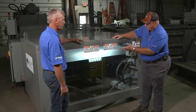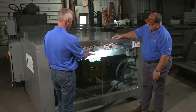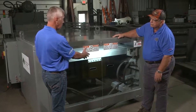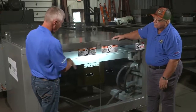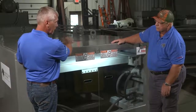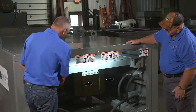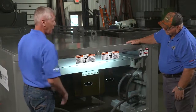The grease station and the placement of the hydraulics — our intention was to bring the majority of what we need to pay attention to and keep an eye on to the back of the baler, so it's visible through our panels. The grease station hits all the points that need grease: the pins and the shoes, with the exception of the rear two cylinder end pins. Once these panels are removed, we're in lockout-tagout mode. But it eliminates 80% of the time somebody would have to crawl under their baler to service it.